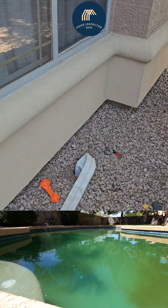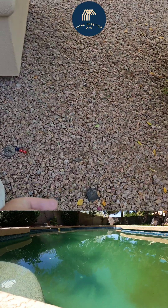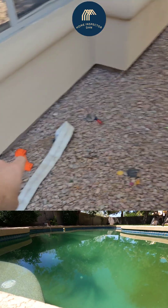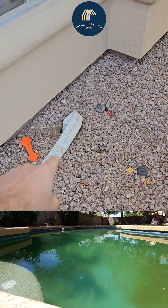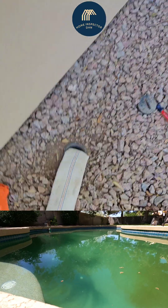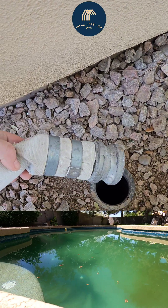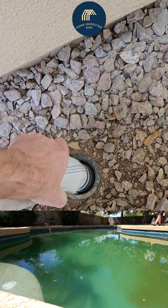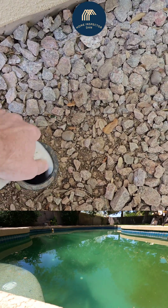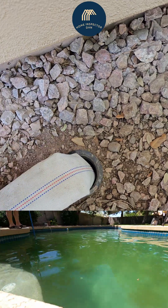With the cleanouts, it's important that you put the hose in the back one if you've got two cleanouts, because these crisscross. You want it shooting back out towards the street, not into the front one, because that one would go back under your house. I've never used a plumbing cleanout before, but I don't feel like getting a ticket from the HOA. This is just a standard two-inch hose from Home Depot. It fits down the cleanout, so I'm going to shove it down there as far as I can so it doesn't pop out.